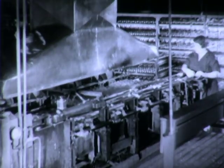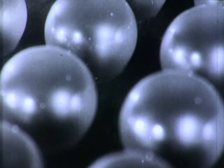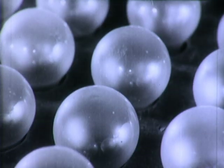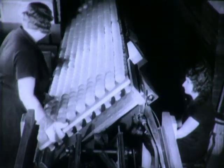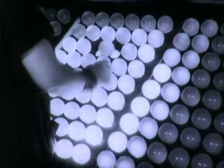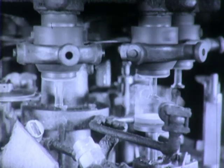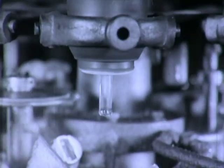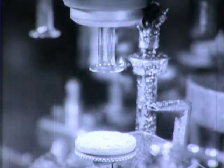First the inside of the bulb is chemically etched. Then it receives a rinse. As the tray moves along, the bulbs get a second etching. With a final rinse, the bulbs are slowly dried and passed on for another inspection. Next we see flanges being made from glass tubing. As the moving arms spin and revolve, intense fires play on the bottom of the tubing, softening it. When the glass is just the right consistency, this little spinning gadget makes a beveled edge or flare. Then an arm releases the tubing, which drops to the correct length, so the flange may be cut to size.